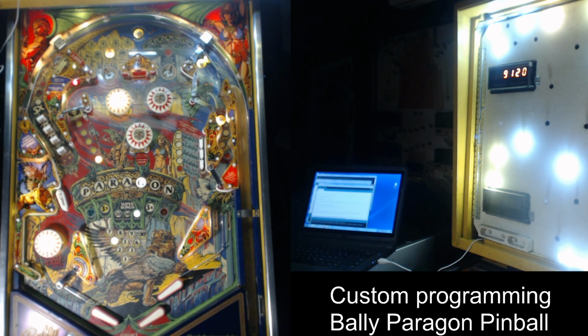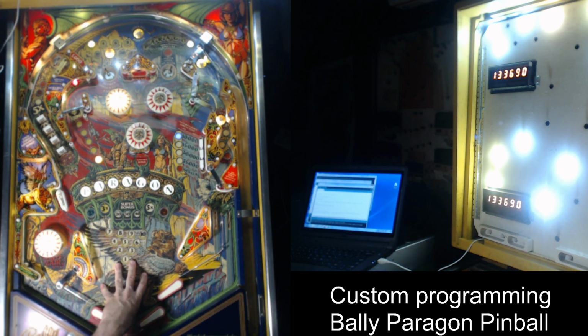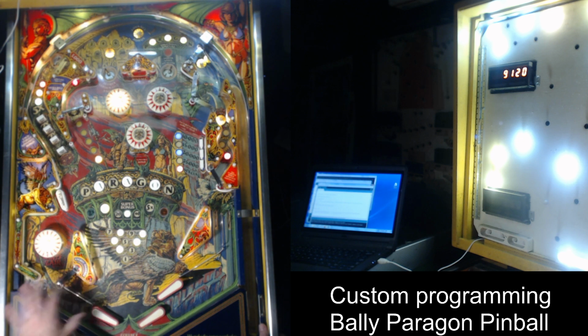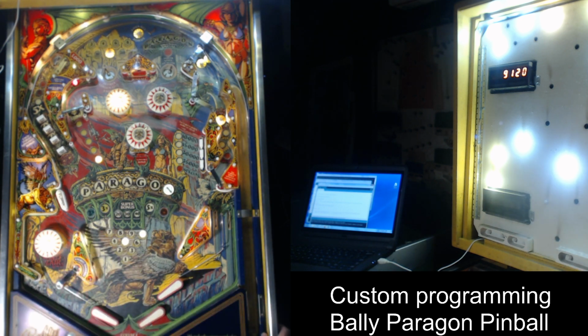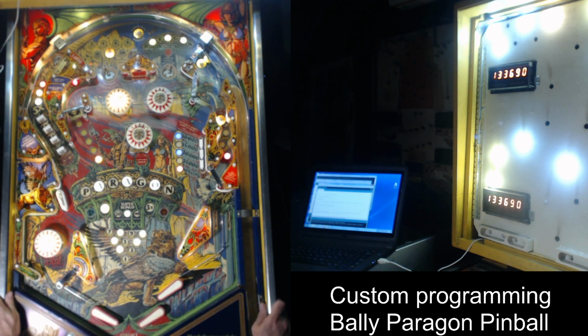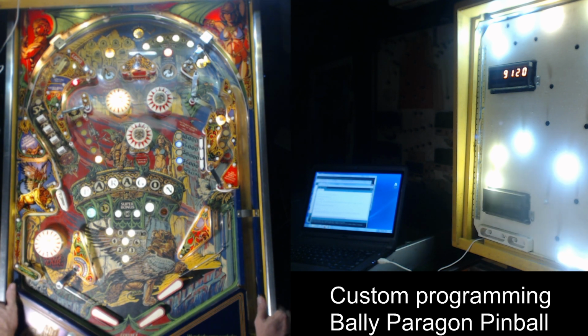And I'll show you what my progress has thus far and explain to you the technology and everything that's behind this. There's an ongoing series of videos in this, but basically the technology I'm using is what's called BSOS, B-S-O-S. Stands for Bally Stern OS, and it's a new technology that's been developed by a small group of people, primarily spearheaded by a guy by the name of Dick Hamill, who's up in the Northeast, and he took on the challenge of seeing if he could take an Arduino and interface it to these early solid state games and control them, and he's been successful at it, and he's redone a few different games. So now there's a small group of us developers who are collaborating and continuing to take this technology further along, modding more games and expanding it.